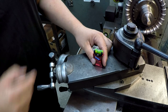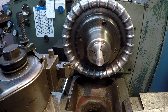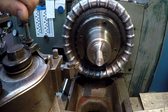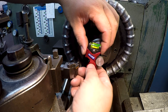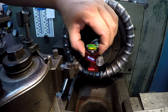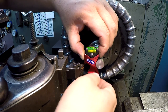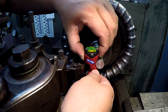So now we'll go ahead and center it up on a piece of material with a tool bit. All right, so I dropped my WNMG turning insert tool into the tool post, and we're gonna check that out. I've actually purposely dropped it just a little bit off center, so that we can see how this is gonna work out for us. So you're gonna have to hold it square against the workpiece there with your fingers, and that tip right there. We're gonna run our tool up and see if we can get it adjusted where it just touches the turning tip, the corner of the tool.